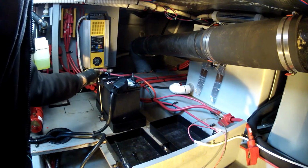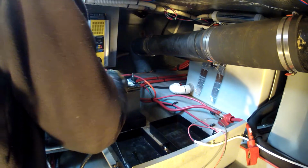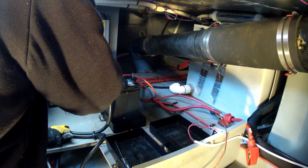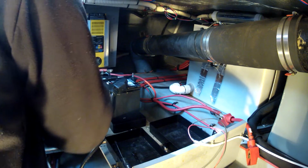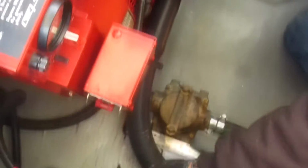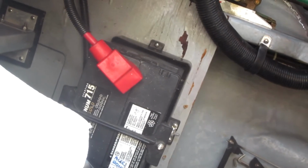On this extra terminal, the red line that's going through onto the positive side runs back to an automatic charging system on the boat. Of course, we've got to be plugged into the AC to produce DC to charge, and it's got 3 banks. This battery, those two, and then there's one more here, which is the standalone starting battery for the Jenny. The generator. That big 9,000 watt Westerbeke.